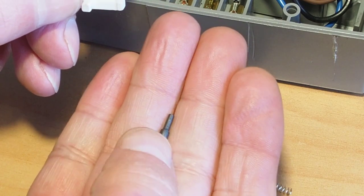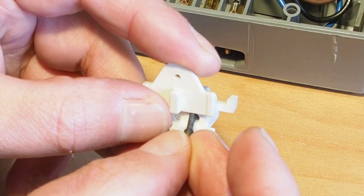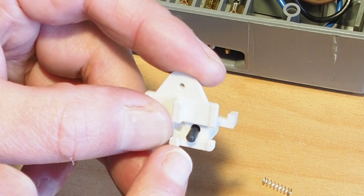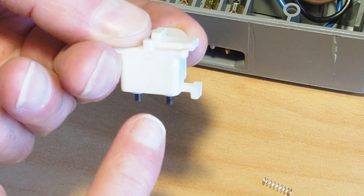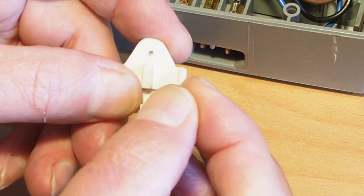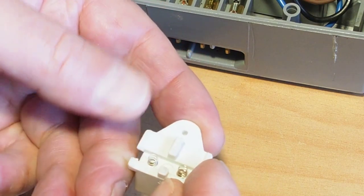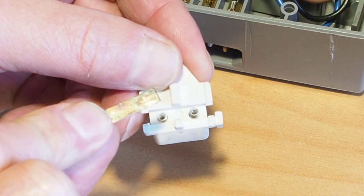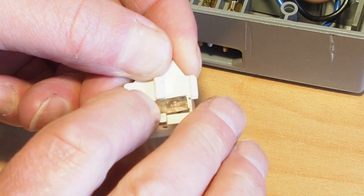When you're replacing them, sit the carbon brush back down in the hole there with the thin end going in first like that. Make sure it pops out the other side. Put your spring in there, and then you get your plate and just sit it over the springs